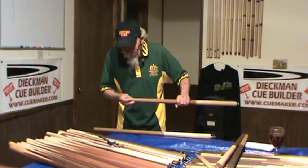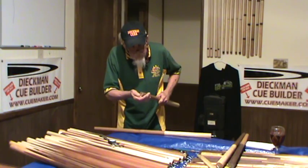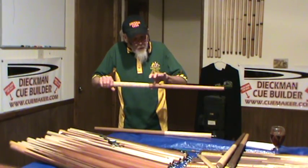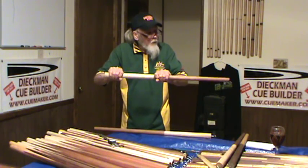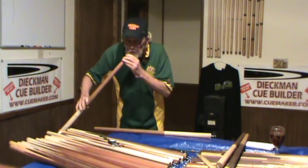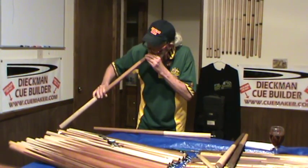Next, you take a saw blade and cut off — one quarter inch beyond depth of center, okay? Flat surface, very pure. Does not have to be perpendicular. Now, you take and put the jaws of your chuck here, and this is the tail stock of your chuck. So this thing sticks out forever, okay? But now you come in and very gently you kiss it — you kiss it with the center, small center. Then go in with just a little bigger center, very shallow.